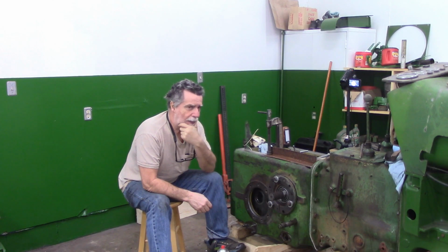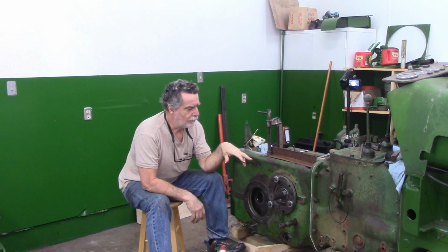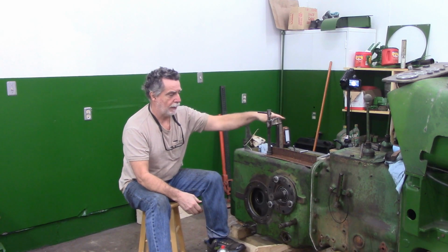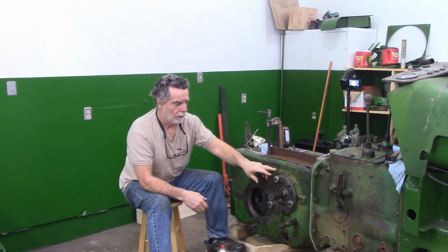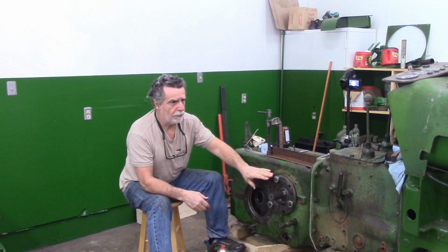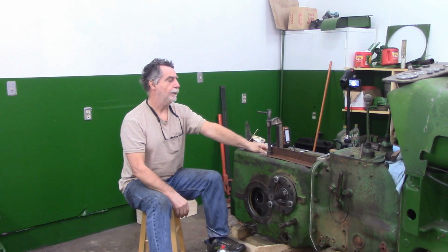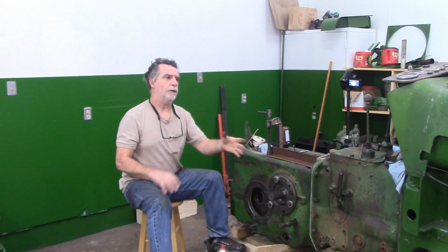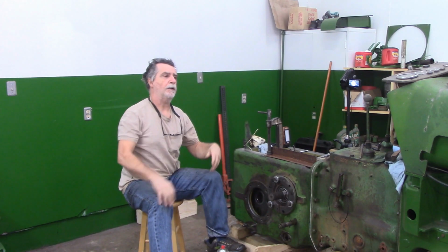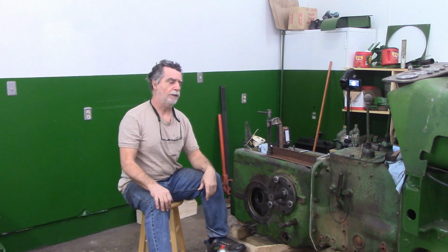Well, alrighty, guys. I am running into a little bit of an issue, which I suppose isn't a huge surprise. I had taken away an upper and a lower 40 thou shim and set it on the other side, and I bolted up the remaining 40 thou here, and I'd snugged it up. Didn't reef on them, but I'd snugged it up. I didn't notice that the crown gear didn't want to turn. Got to the other side, so over there I took the 2 halves, the 2 40 thous from this side, and I was putting them in on the other side with the 40 thou that was on the other side. And while I was doing it, I realized that that gear didn't want to turn.